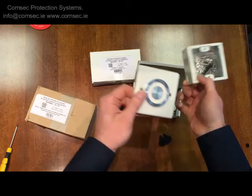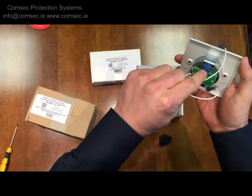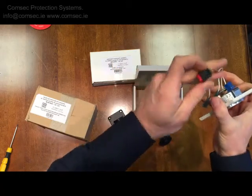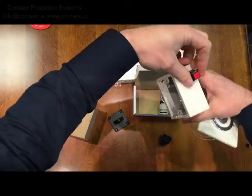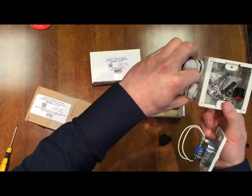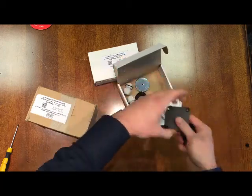The holder itself is a 24 volt holder and it's a simple termination — it's just positive and negative from your power supply unit. This clips onto your press-to-release button and goes into your back box if you need it. Inside the box you also get two glands for terminating the cable in and out, and you get the retainer plate which is what gets fitted to the door.